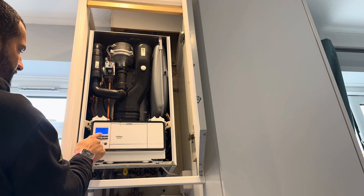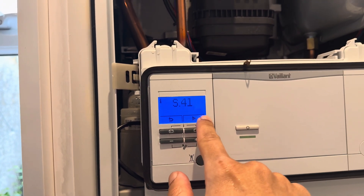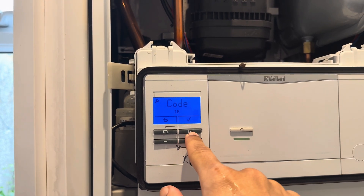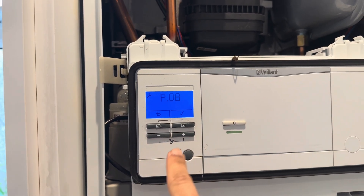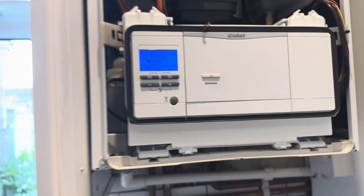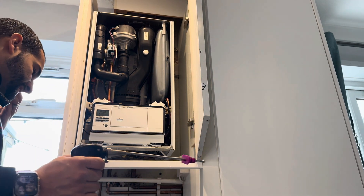Put this into service mode — so let me show you from the beginning. Press the two I buttons, then top right to take you into the settings. Go up to code 17, press the top right again until we get to P. P1 is maximum, P2 is minimum, and P6 opens up the diverter valve, which is the best way to top the pressure up. Put it on my new face saver — these are brilliant, you should get some of these from 8BitGhost.